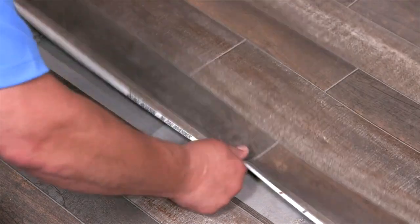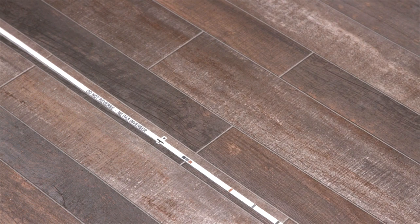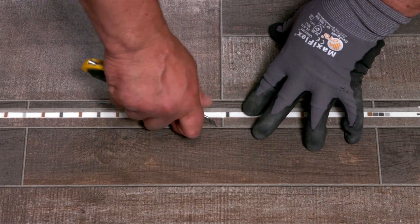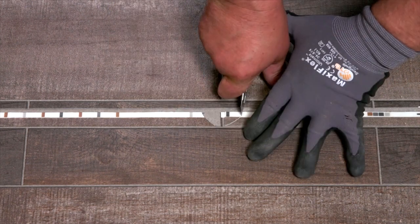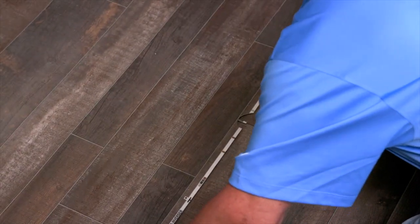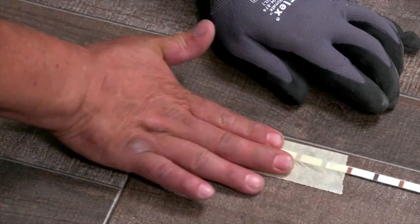Once the first piece of flooring is positioned, cut the second piece of flooring, leaving extra material for pattern match. Cut windows to ease the pattern alignment process. Overlap the seam edges and position the flooring for an exact pattern match. Place masking tape at the seam overlap to prevent the flooring from moving.